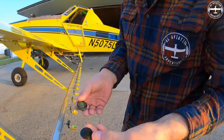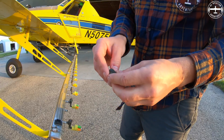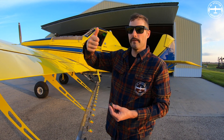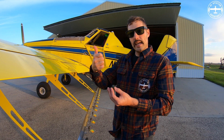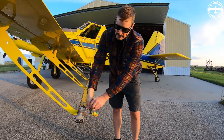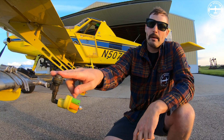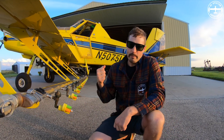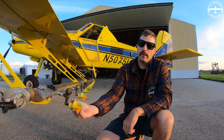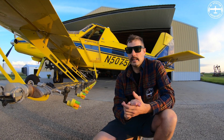If I pull this cap off, inside I have this little piece of rubber — that's a diaphragm. How it works is it sits on the inside of this cap. You can imagine this like a straw in your drink: if you put your finger over your straw when it's in your drink and then pull your straw out with your finger on it, your straw keeps all the fluid inside. When you take your finger off it all comes out — that's how this works. When this cap is on with that rubber diaphragm, it seats in there like your straw and the drips completely stop. This cap is a PSI-rated cap, so there's a spring in there. When I push that handle down, the boom is pressurized, and that pressure is more than this cap's spring pressure, so the rubber diaphragm goes up and fluid can come out. Those are the two things in the spray system that ensure nothing's going to drip or leak, which is obviously very important.